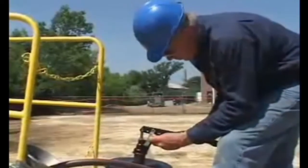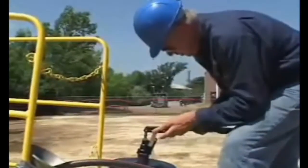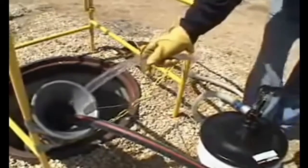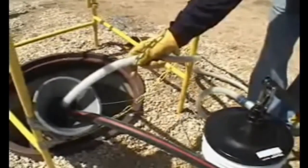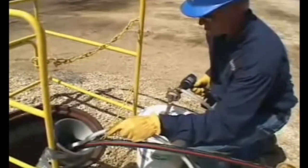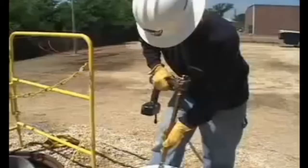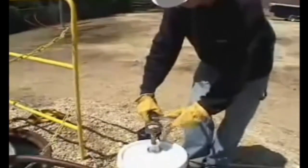The pump instructions include ratio setting recommendations. This adjustment is quick and simple. The LP3 pump mounts directly onto a five-gallon pail. A 10-foot output hose is standard. Operate the pump with the up-and-down handle and increase or decrease the rate of pumping to control the lubricant flow rate. The Polywater pump LPD5 is powered by a quarter-inch or larger electric drill. The LPD5 will pump all Polywater lubricants except the very thick gel DynaBlue.